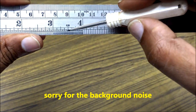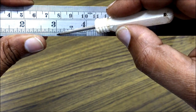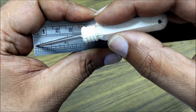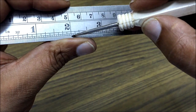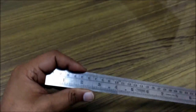Similarly, between three and four inches there are 64 divisions — each graduation is one sixty-fourth of an inch. From the start of the steel ruler up to three inches, each graduation is one thirty-second of an inch. So let's take a few measurements.